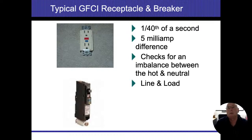The ground conductors and water services, all right. So I got a question, did you cover wire sizing for grounding electrode conductors, either by rod or by water pipe? And the answer was yes, I did. So the GEC, whether it goes to a water pipe or to a ground rod, has to be either a number 6 copper, and that's for under 150 amps, or a number 2 copper for 150 amps and over. So number 6 for under 150 amps, or number 2 if it's 150 or more.